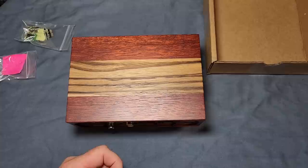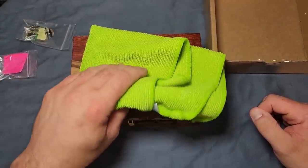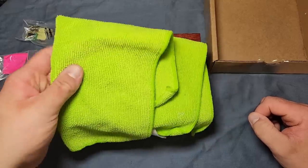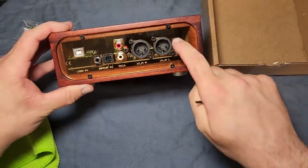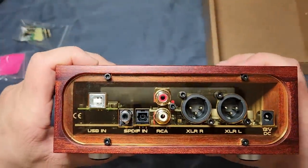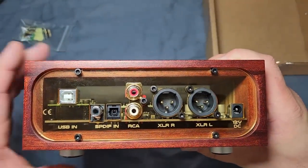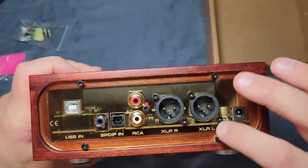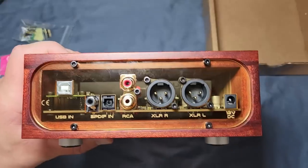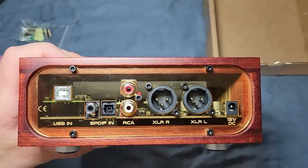A cleaning cloth — I use a clean microfiber cloth — is helpful to pull the op amps out without stabbing yourself, because the pins on them are very sharp. You'll probably also want to remove your fingerprints from the acrylic plate. Around the perimeter of the back panel you'll see four Allen screws which hold the acrylic plate to the wooden case — those have to come out using the Allen key. Leave the other screws alone; just the four on the outside need to come out.